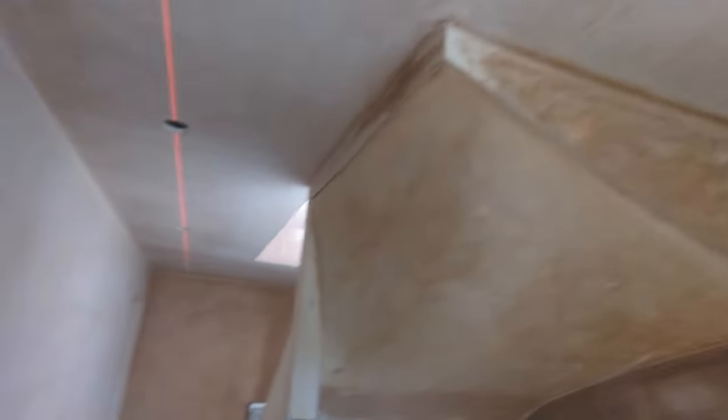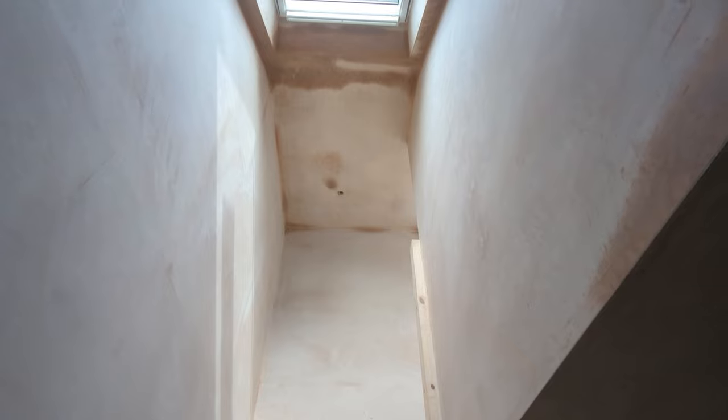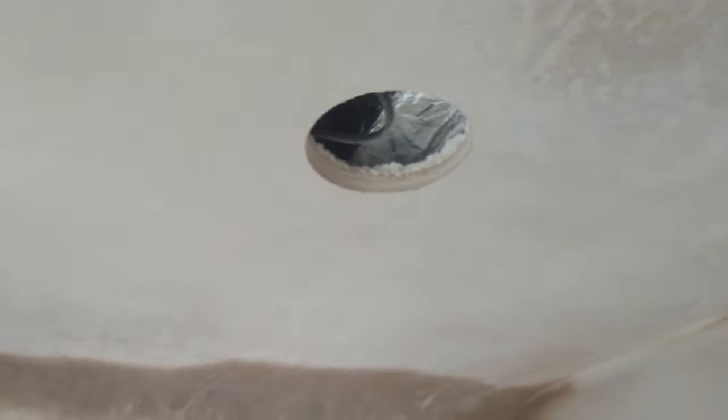That is nearly it — there is one left for a clean sweep. There's one, there. If you've watched our videos, you'll know that a plasterboard went up and the measurement was forgotten. So I had to go back through my videos and work out where it is. I've gone through my videos and apparently managed to work out that it's there. I thought I'd messed it up — but you can see that there's a joist there. If you remember, in another video I cut a bit of that joist out to accommodate that. So this one could be in the middle, because this timber only spans from the steel to this wall. I could afford to just nip a bit of that out. I thought I'd messed it up, but I hadn't — it's all there.